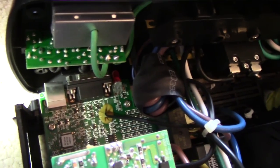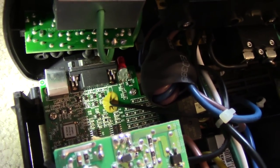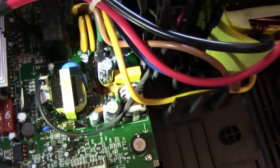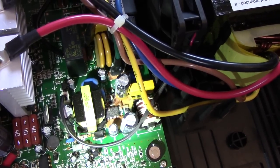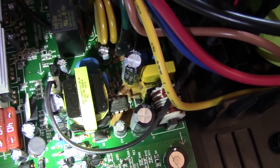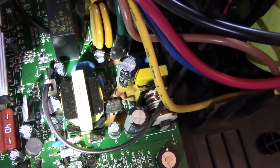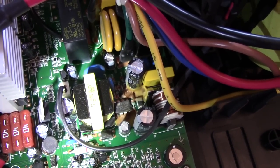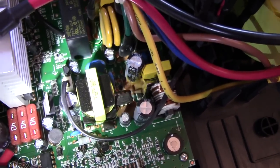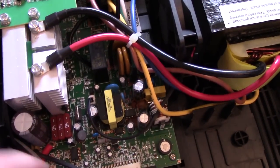I'm going to try and use this flashlight sparingly here, but that is kind of the color the glue is supposed to be — a yellow color. If you take a look down here at this capacitor at the bottom, you can see some glue, and hopefully this comes across on camera as far as the color change goes. On the right side you can see it's more yellow, and on the left-hand side you can see it's starting to turn brown. So it looks like I got this one sort of just in time. I've measured this brown area with my multimeter and it has not become conductive yet, which is good, because this exact thing is what will eventually cause a failure.